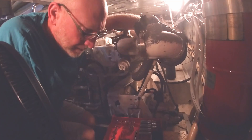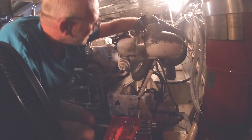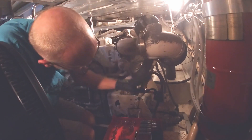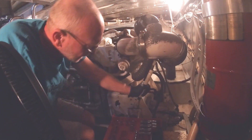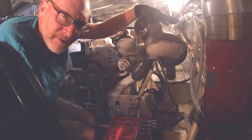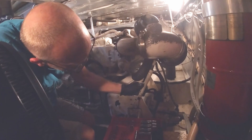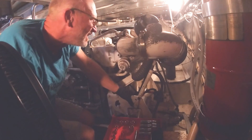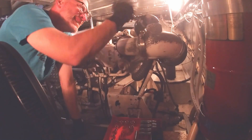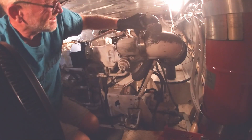We've got four hose clamps on the big bellows — those are removed. Next up, I'm going to remove this band clamp that holds this bracket on, and that's to support the weight. This is a very heavy cast iron, replacing the stainless steel elbow, so this kind of holds that up. That's the next one to go.